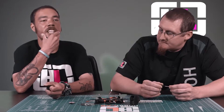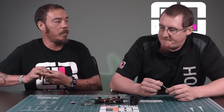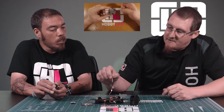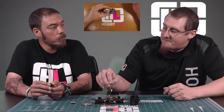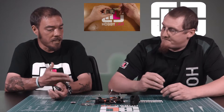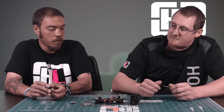So the initial installation and setup of this board — can you go through that? It's a pretty easy board to set up for the most part, but there are a couple things to keep in mind. You really need to have a 5-volt Pololu 1-amp regulator on it. We tried it with a Matek PDB with a 5-volt rail and it was not strong enough to power your video camera, VTX, and flight controller all together. So stick with the Pololu — they recommend it and it's pinned out for it correctly. It does not come with one, so make sure you pick one up.